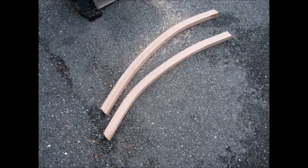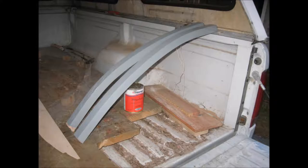Here are the two frames after they've been through the planer. That's really cleaned them up and they're ready for the next step, which is painting the frames. I painted all the frames that I laminated with three coats of Interlux Bilge Coat before I started getting them ready to install into the boat.